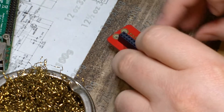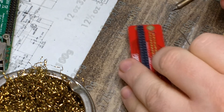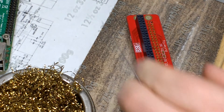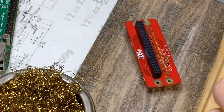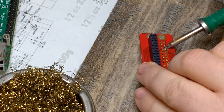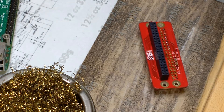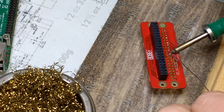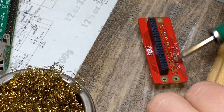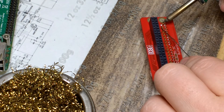With the male header in place, the Butterfly board should sit on the table fairly flat, which makes soldering the male header a little easier. Again, start by soldering a pin at each end and check the header is on correctly. And a little more flux. These go a little quicker, as it's easy to get in with both the solder and iron.